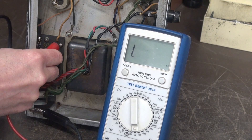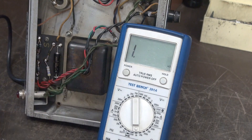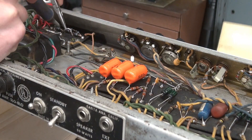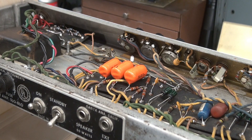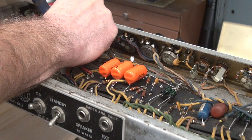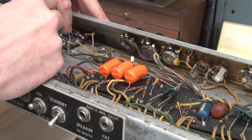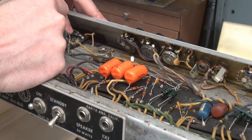Alright, let's go ahead and change the diode. We'll bring this thing up and ensure we have the negative voltage required for the output tubes. Popping this guy out — the beauty of these eyelets is that removal of parts is pretty easy compared to a circuit board. Remember, this is just our initial checkout. I'm not going to put in the diode, say it's fixed, and send it back to the customer. I can see other work that's been done on the amp, so I really need to give it a thorough inspection.